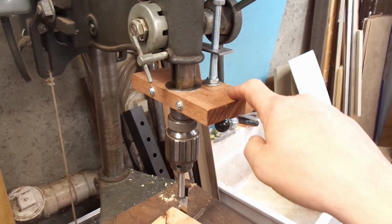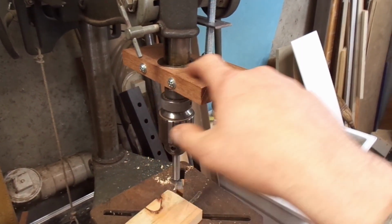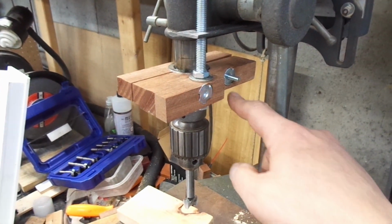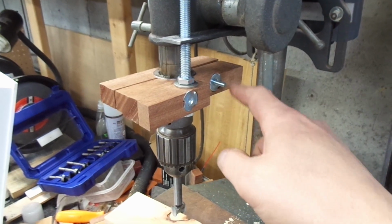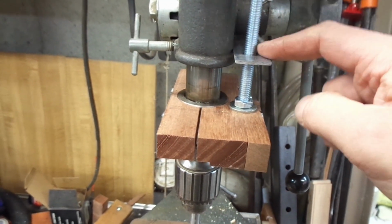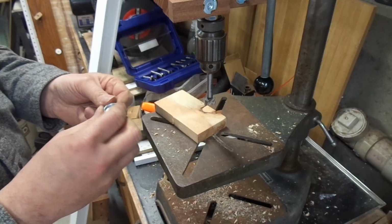So at this point, I think the proof of concept is done. These are 2 number 10 screws going through. That one's barely long enough to engage the T-nut, and on that one, of course, I got a little extra. Up on this side, I had to file this flat, because as this comes down, you want that to engage and register against the flat surface.